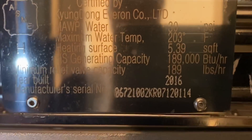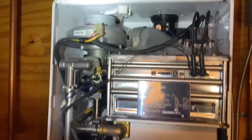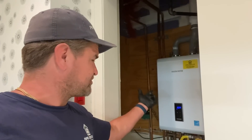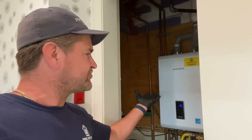This is a 2016 model — it's got the latches. I'm going to call Navien while I'm here on site and make them aware of that defective heat exchanger. Shame on you Navien. Every single one of these machines are death boxes — five to seven years is all they're good for. This one is from 2016 and she's practically dead. We have a failed heat exchanger.